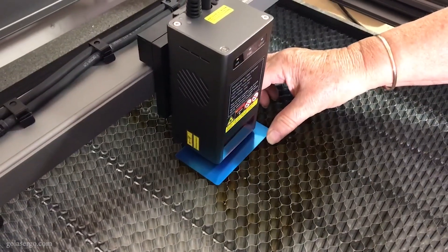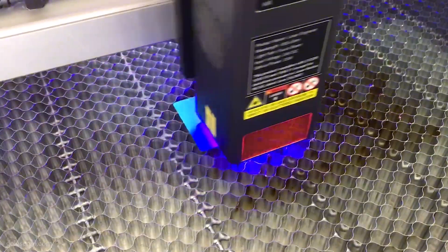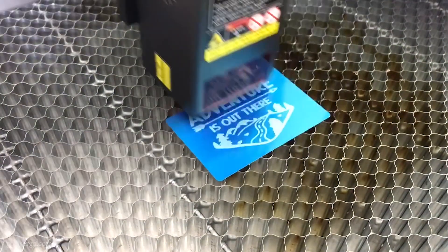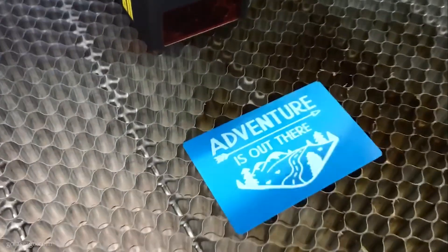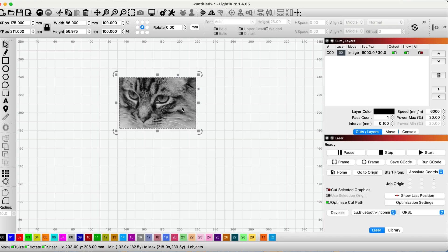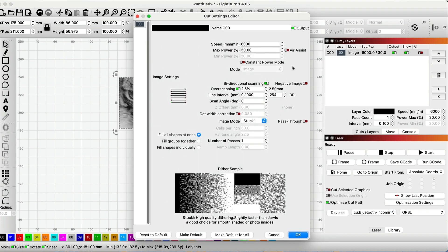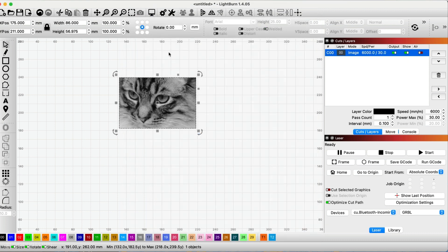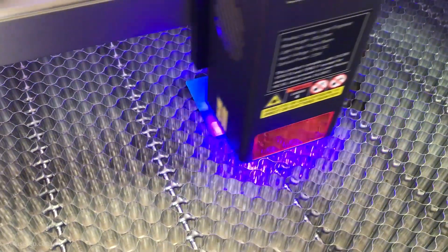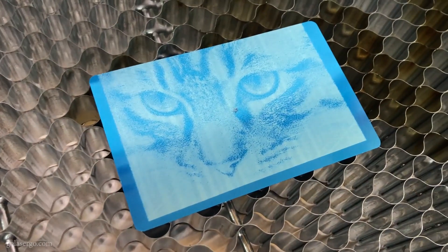We always like to test on some aluminium plates, so we downloaded a free file from Love SVG — there'll be a link in the description. I always like working with aluminium; it's a bit like MDF in that everything seems to turn out great. We also tried engraving a photo using the negative option in Lightburn — you can see the difference with the negative option off versus on. It came out okay but we still need to do a little work on the settings for this.